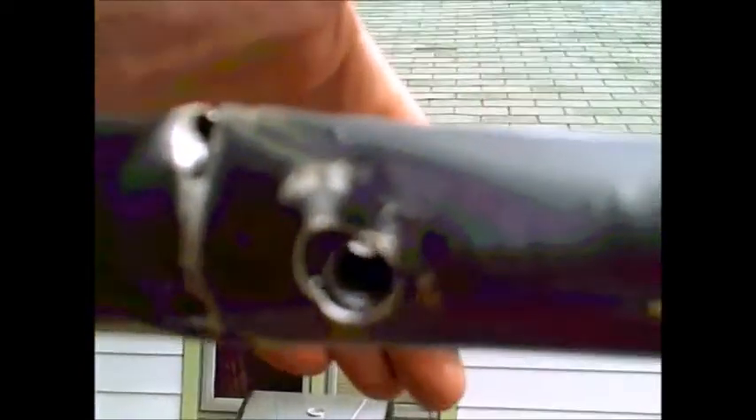I ran into a slight alignment issue. I got the one bolt to go through really well, and that kept the other one from moving around. Once you get that one locked in, you can go ahead and open these holes up. You want to go a size or two bigger than your bolt so you've got some room to play with in case it doesn't line up perfect — tighten it down and it'll be fine anyway.